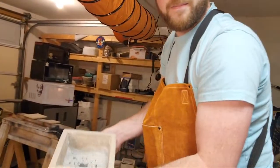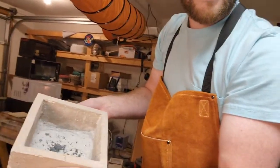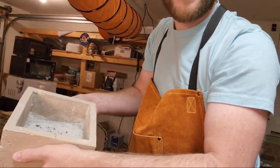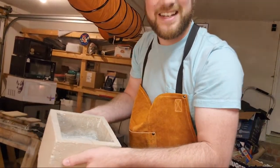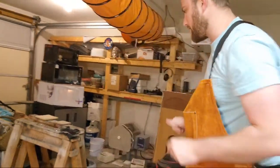And I always layer the piece that I'm doing in the center of the crucible. I don't know if you can see that, this has been centered. Dealing with two different centering: centered the part in the crucible, and I'm about to center the part in the microwave. So now that I've done that, I'm going to go ahead and get a little spoon, and we're going to layer just about 2 teaspoons, maybe 3 teaspoons of the flux. So give me a second here.